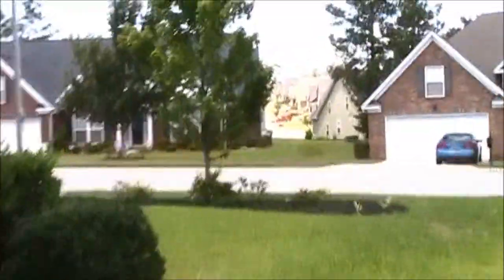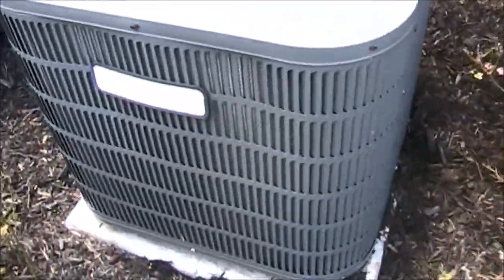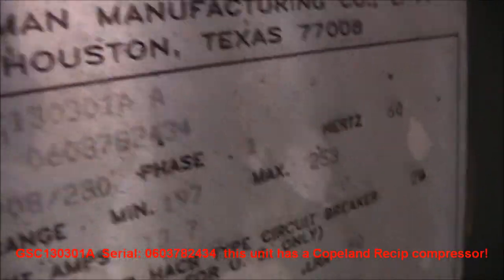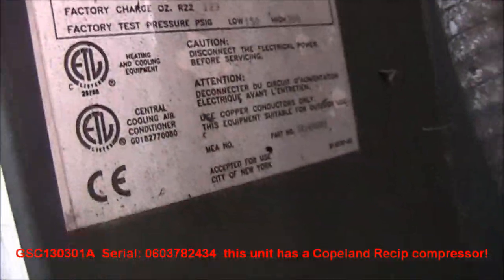I see houses that have them. There's more Goodmans. This is by Essex Homes. Another Goodman — at least this is a dual zone. Now there's one, that's for the second story. Here's the one that's running. Gas heat. Alright, 13 SEER. This is an '06. It's a GSC 13030. It's a two-and-a-half ton straight cool.